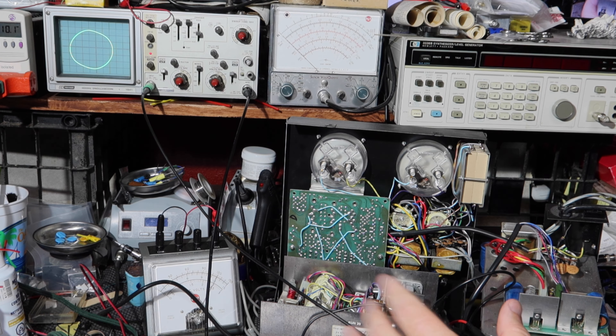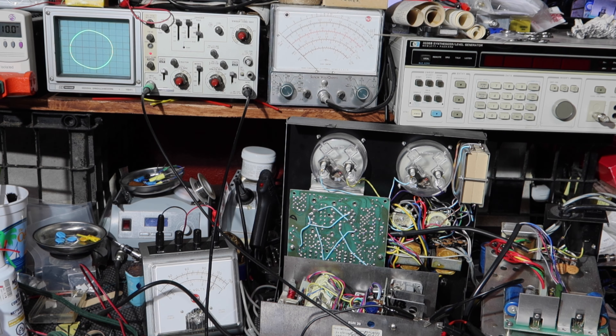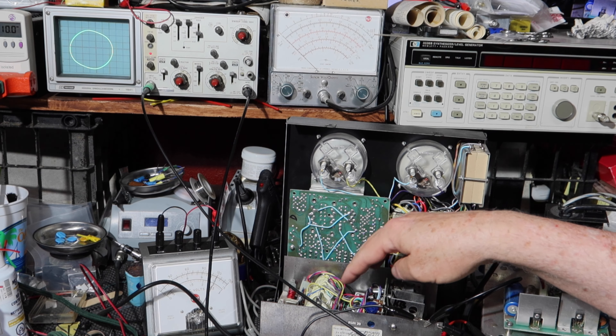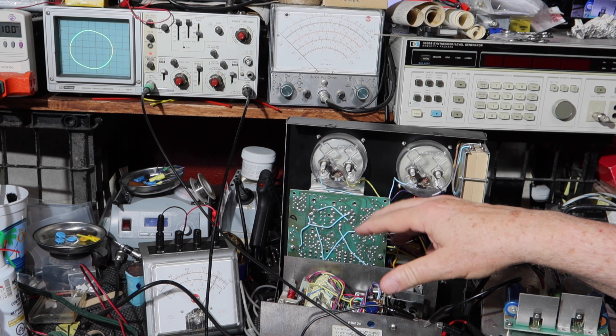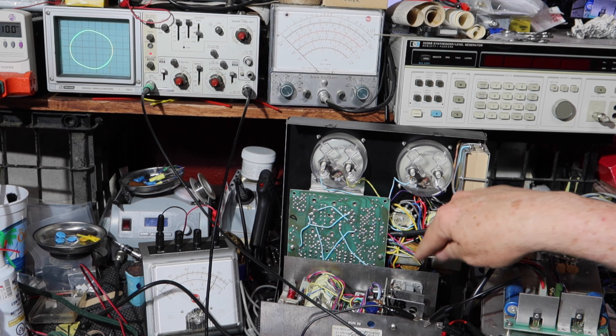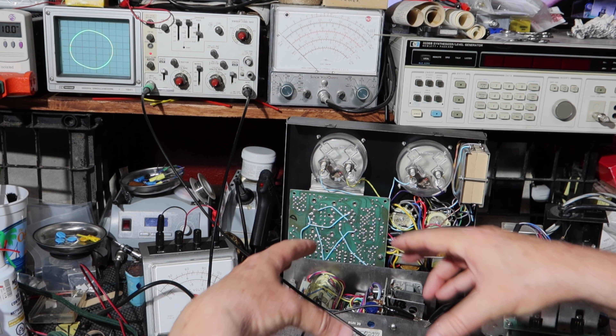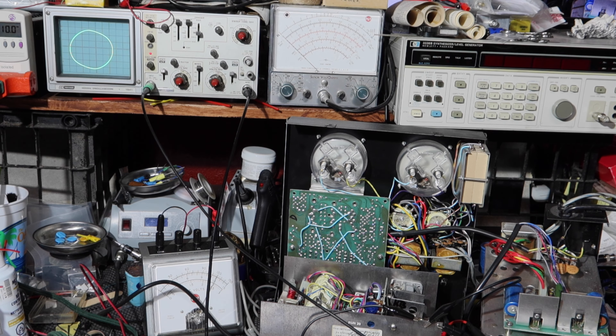I don't have a lot of the instruments I might need to do things more around the multiplexing and separation. I do have some kind of problem with the connection in here on that coil for doing the 10.7. I'm going to put it back together again and we'll see how it works. If I need to, I may have to tear this all apart and clean all the switches and check for bad solder connections. But for right now it's holding so we'll just see how it does. In terms of fixing the shaft on the RF control, I'm not going to do that right now, and when I do I'll probably recap the unit anyway.